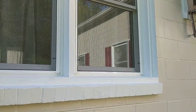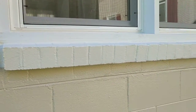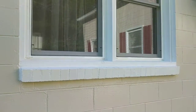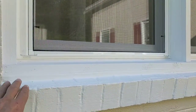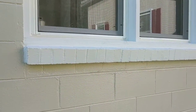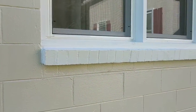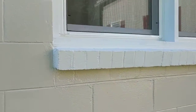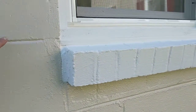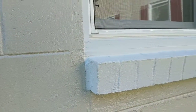The only thing I didn't like was I had to put in that little spacer piece right there. I don't have the equipment to undercut a two-by to make it fit — it's just the way the block was. The sill block was not even with the block on the wall. It's a four-inch block, then a space, and then this row of sill bricks — concrete brick, actually. They weren't even with one another. The back side of these bricks is sitting down about three-quarters of an inch lower. That's where the block is on the inside — actually, it's a little bit higher than that.